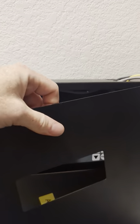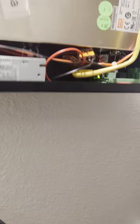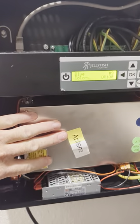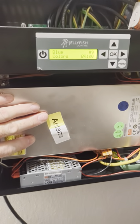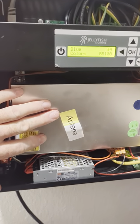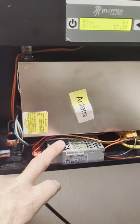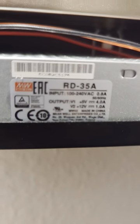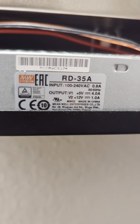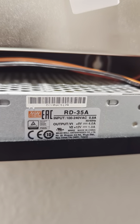When we take the faceplate off we can see the screen in the middle. We've got our 48-volt power supply — this is what powers the lights themselves, and it's only on when you turn the lights on. We also have the 5-volt and 12-volt power supply. If you look closely, you can see dual voltages coming off of it: voltage 1 is 5 volts and voltage 2 is 12 volts. We'll go over that in a bit more detail in a minute.